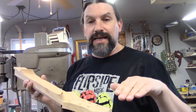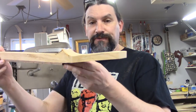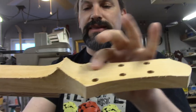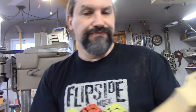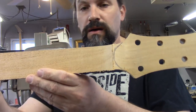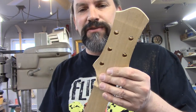The cool part about the old man machine is that unlike a store-bought thickness sander it has a smooth table, so you can push the piece in and pull it back out again — which makes it perfect for headstock thicknessing. I took a little bit more of a cut than I needed to and had to back it off, but you can see we're establishing our volute here. We want the point of the volute to be right under the nut. The volute will all be shaped by hand or by the deadhead sander later in the video. I've got five more of these to do, all to the same thickness.